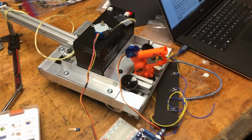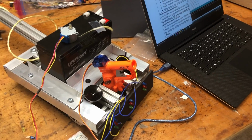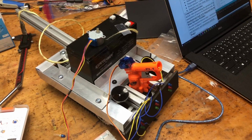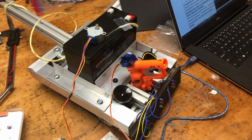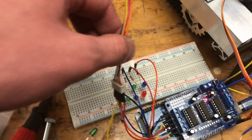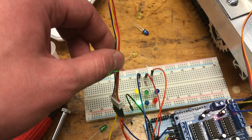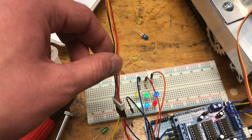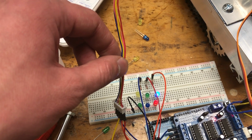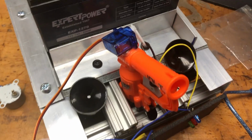Our third task is the disturbance system, which is going to attempt to mess with their sensors. And the two sensors that we want to name specifically are their ping sensors and their Pixy camera. We have some simple code to blink some LEDs, and later on they're going to be fastened as headlights so that we could really shine some light on their robot so that we can distract their Pixy camera.